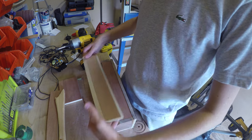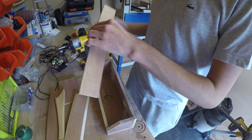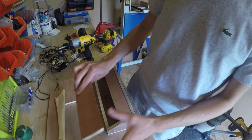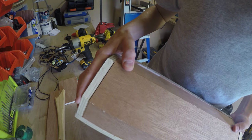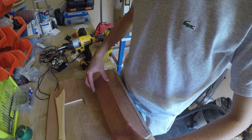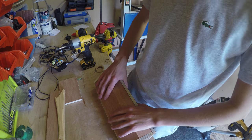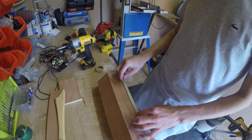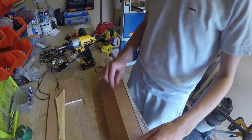Right, so off camera, just because it took a while, I got this small strip and I was careful to take my time and dial it in, and it fits really snug, which is good. And then this dual bevel bit also fits flush. Now I've left a small gap, I don't know if you see that, a small bit of play either side, so that when I hinge this part it will open accordingly, because if I overdid it, it would obviously come down and hit the sides, which I don't really want to happen because it will start to chip the wood. So now I think we will route this top bit and make it flat and flush, and then get on with putting the hinges on, getting the speakers in, and then I'm going to paint the rest of it.